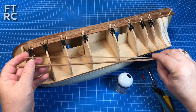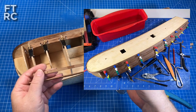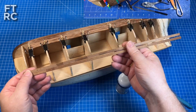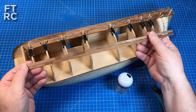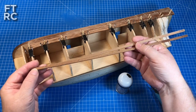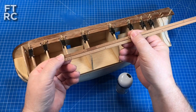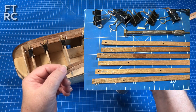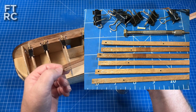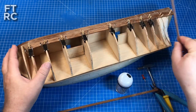Now, in the previous video, and there'll be some photos here, the planks were all put on wet and bent and pinned in place. Once they're dry, I just pull them off. I find this is the easiest method, because they're already dry, bent, ready and shaped. I make sure on the back side I mark each of the planks with an arrow pointing to the front, to the bow, so I know which way around they go and also which number. So I've got 7 and 8 here. This one, 7, is going to be the next plank to go on.